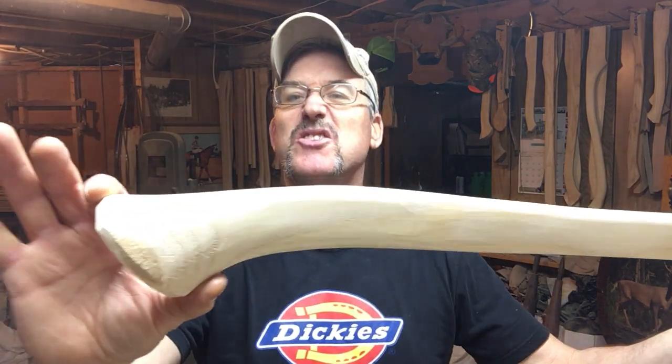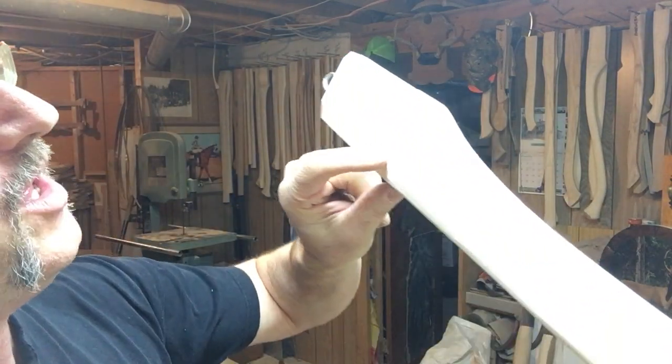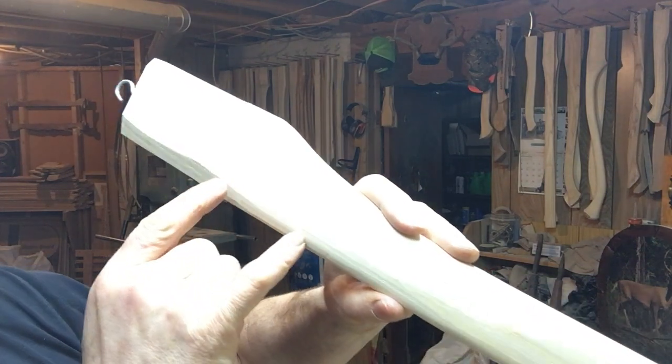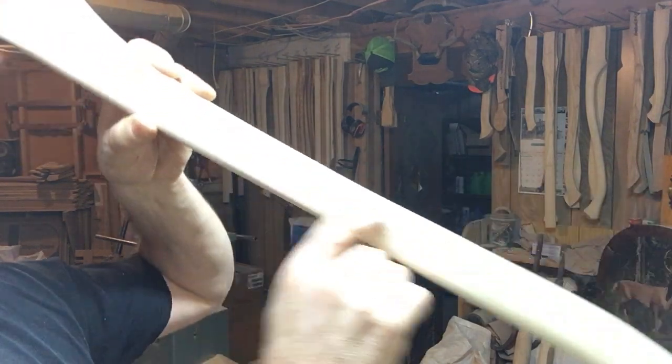If handles hang on the right-hand side of my door there's usually always something wrong with them. Here's one — this looks like a beauty. I actually made an order of racing axe handles last week for a group down in Montana, a forestry college. But if you look really close you can see there's a little bit of a fracture here. When I was doing the wood up I could actually see that hairline fracture running down, and there's actually a larger one right here. I kept looking at it and thought — that's not going out the door. It can be a wall hanger, but you're not going to use that in a good axe.